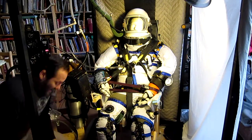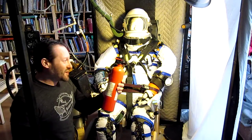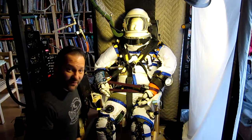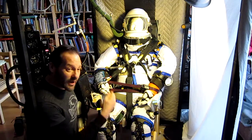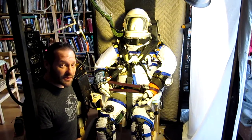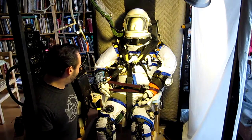Alright, so this is a test — keeping the fire extinguisher armed and handy right here. I'm going to go ahead and inflate the suit, bring it up to 3 psi, and do a test of the pressure equalizing solenoid. I'll explain that in just a second.